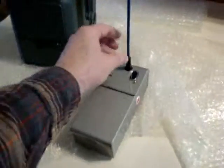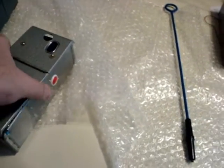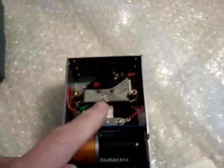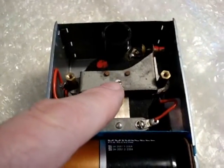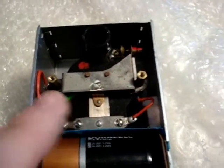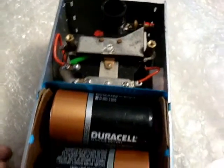The Raticon transmitter is a spark gap transmitter. Basically what you have is a coil that has two different windings on it. The first one is the buzzer. This small screw here sets the buzzer for optimum vibration — the rate. Consider it an oscillator if you will.